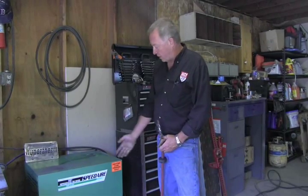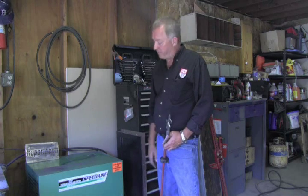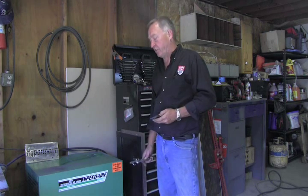Really the best case situation if you're living in a humid climate is to have a device like this little unit down here. This is a major brand — it's a refrigerated air dryer. These aren't cheap; this particular one is probably an $800 air dryer. If you're using your plasma for production in a humid environment, this is the best way to keep your air nice and dry.